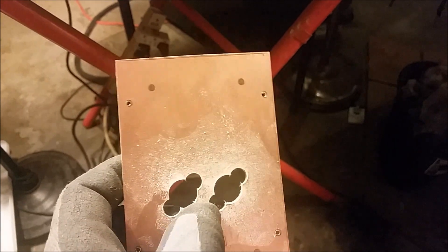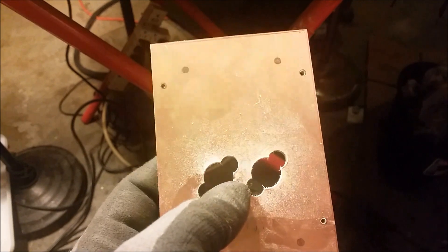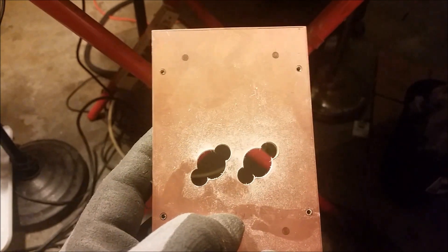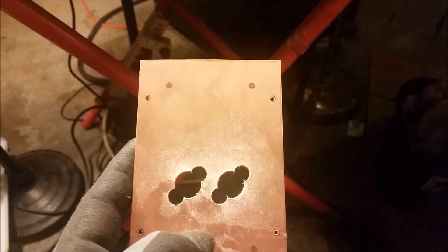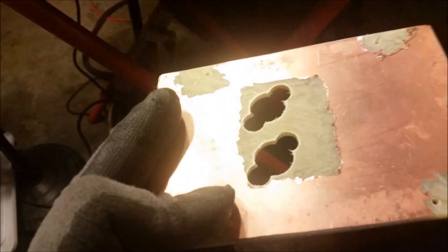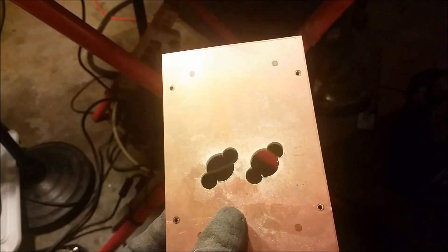The only thing about it, you gotta be right dead on precision. And a little trick I've noticed while doing this: if I'm using double-sided board, I like to take the copper away from the back. It makes it an easier transition once you're getting down there close towards the end. Makes it a lot easier — you don't have to worry about getting all the burrs out on the back. See, there ain't no burrs, really. Just the burrs of the phenolic, which ain't gonna hurt nothing. Might as well should have just taken all the copper off, shouldn't I? Alright, I just want to throw that in there.